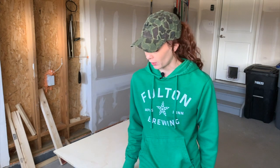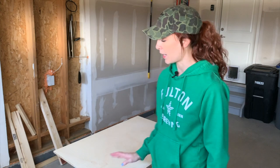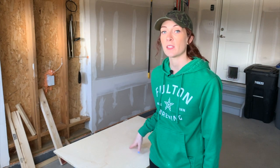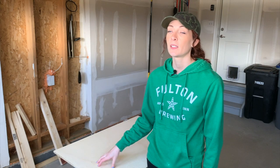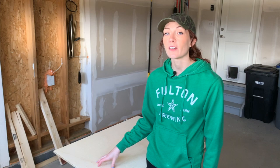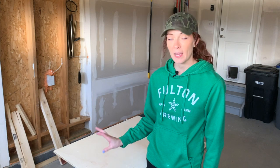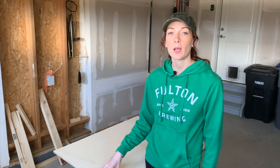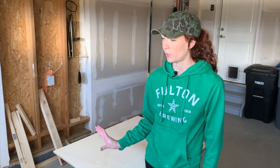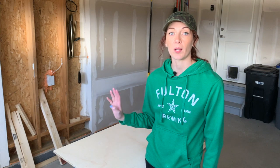What I do know how to do, and what I am gonna start doing, is I'm going to treat all of our planks for our shelves, and get them prepared so that we can put them up finally and get our shelves in order. So I'm going to sand all of them, clean them, condition them with oil-based wood conditioner. I'm using oil-based everything. Stain, and then polyurethane. I think that's it. I'll show you everything I use as I go along.